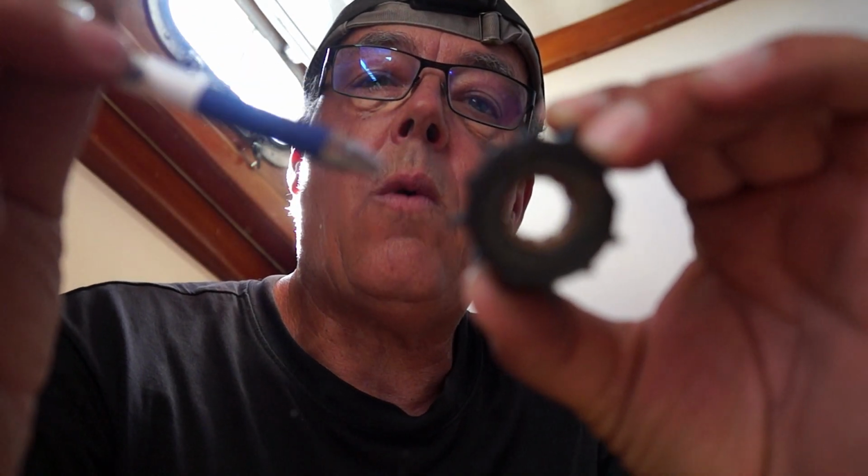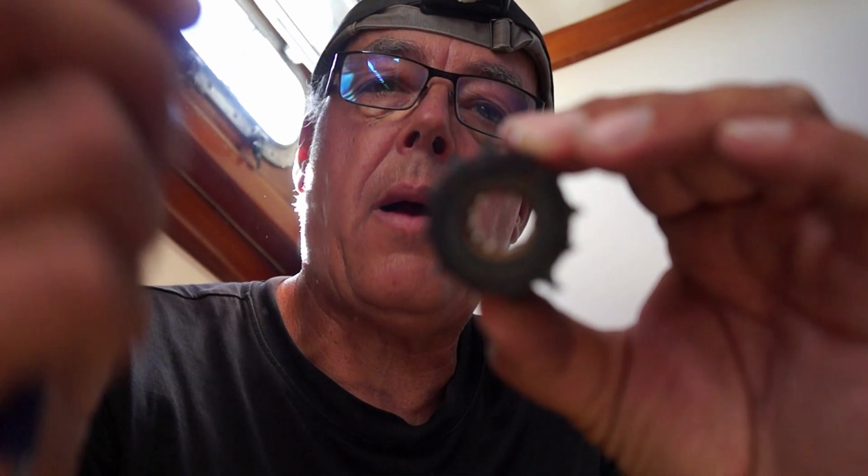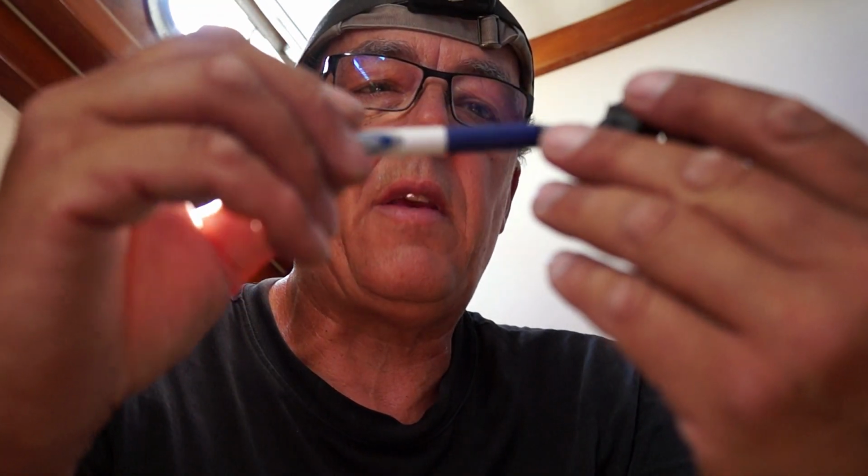Well, we're getting so close to launch time that I've got to take a quick look at that engine. One issue we did have is late in the year when I was winterizing the boat, I did not get enough water into the system before the impeller, which is probably dried out and quite aged, lost all of its fins. So, before we start things up again, we want to account for each one of these. And they should be collected somewhere in the engine.